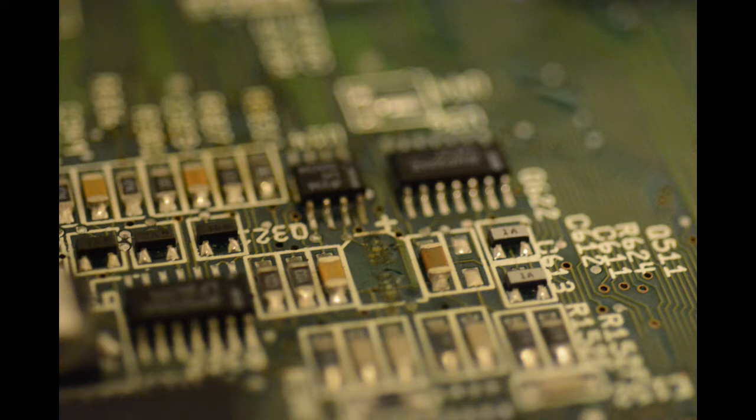But after a couple of days away from it, I plucked up the courage, bought some equipment. So I bought a copper sheet, I bought some special epoxy that is at high temperature to try and sort this out. So I made the correct size pads, used the epoxy to secure it, and also repaired the traces around it. And yes, it works, but only for a short while.